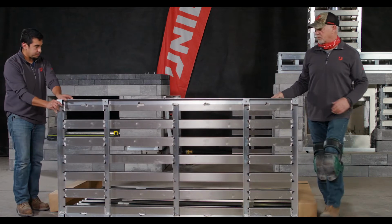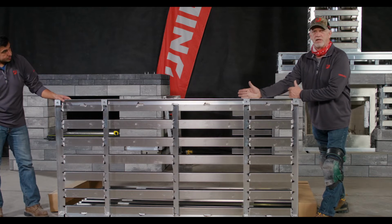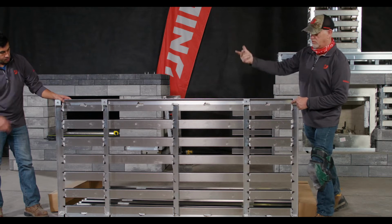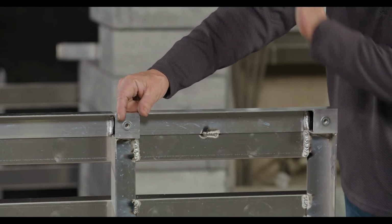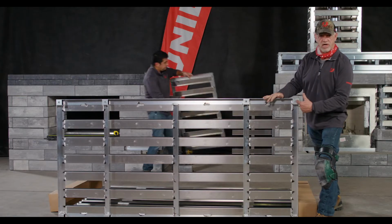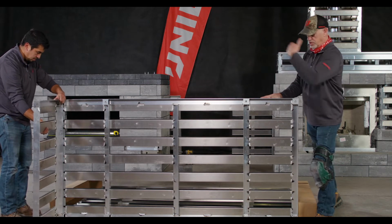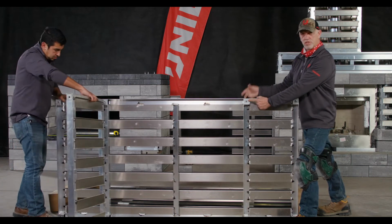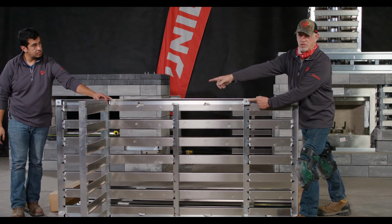All right, let's introduce new for 2021, the Fireplace Component. This is the component that you're going to see. We stood it up on end in your direction to show you what makes it unique. Auggie talked about the overall lengths, but I want to point out the bolt positions here. Again, end clads. As in any of our cabinet systems, we have the mounting positions for attachment of an end clad on the exterior. But notice too on the interior here, at 18.5 inches, which is our Ucara dimension, to achieve 0 cuts, we have the opportunity to install an end clad there.